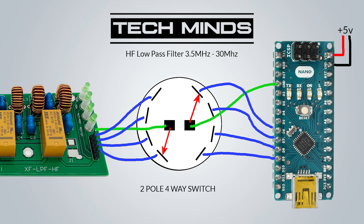On the right side of the rotary switch we can see four blue wires going to the Arduino digital pins, and a green wire going from the right side center pin to a ground pin on the Arduino. The blue wires are connected to D5, D6, D7, and D8, but you can use any of the digital pins as these are defined in the Arduino sketch.